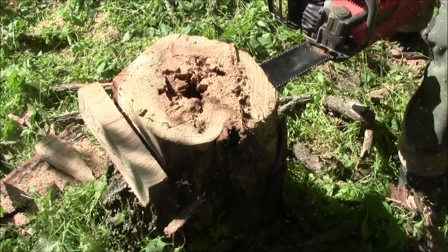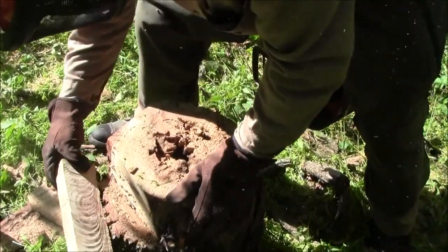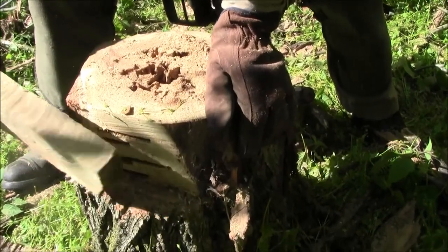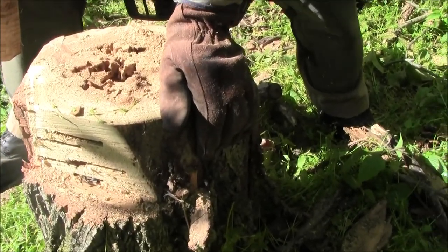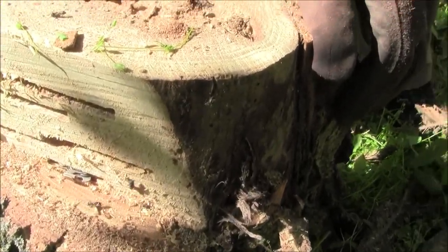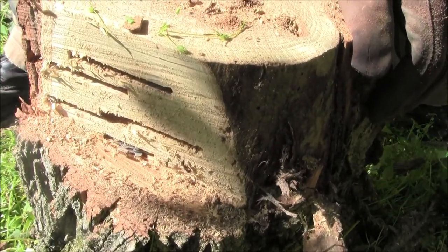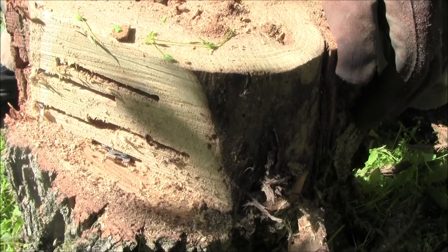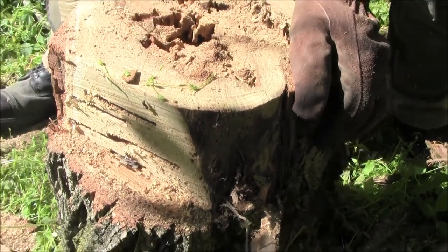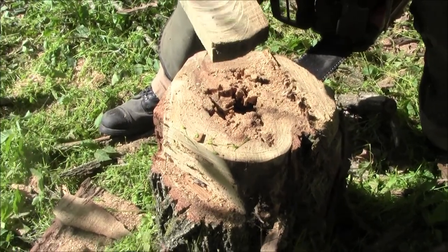There we go. I saw that puff come out and I did not touch it. And they're right down here. See, you see one tooth out there. Move in close. See one tooth. If you ever have to do that, you want to be watching for that puff of cuttings, and don't be pushing too hard. So that's how you do that. It's the first time I've ever done that successfully.